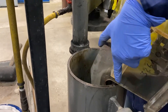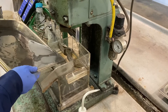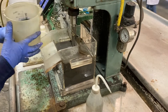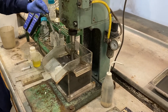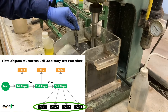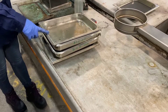Float the concentrate for about 80% of the flotation time recorded in stage 1, then filter the tailings in the cell. Place the collected concentrate from stage 2 back into the cell for the final flotation stage. Add water to the correct level. Turn on the agitator and measure and record the EH and pH of the flotation pulp before flotation. Add any frother or pH-EH modifier required and record the pH and EH prior to flotation. The total flotation time for the final stage will be around 80% of stage 2 flotation time.